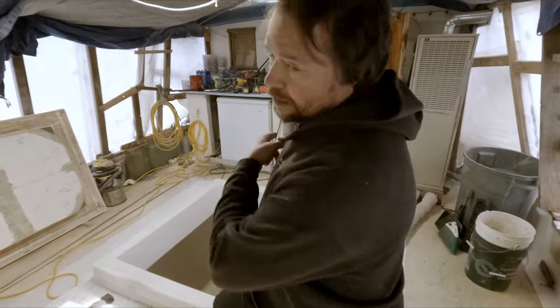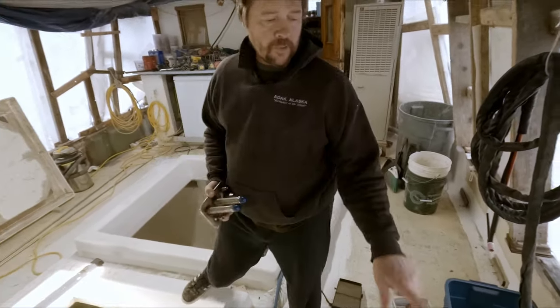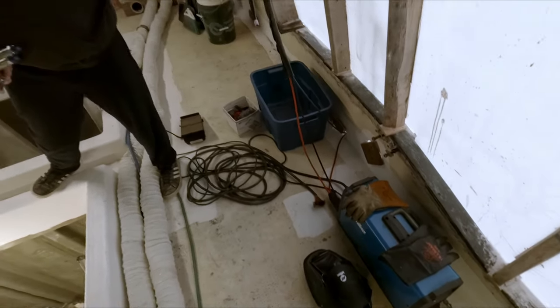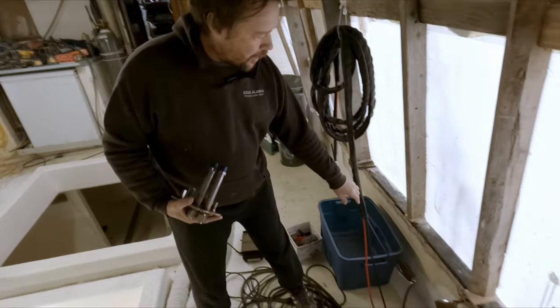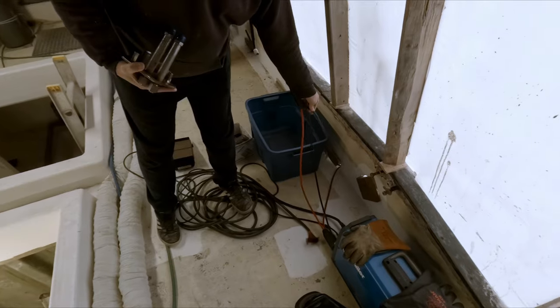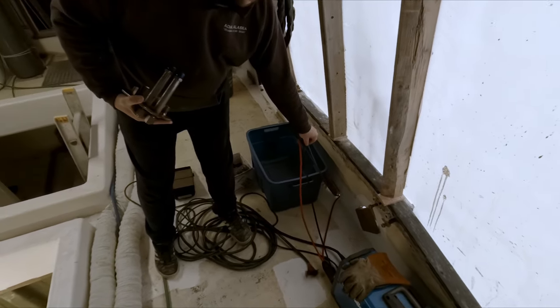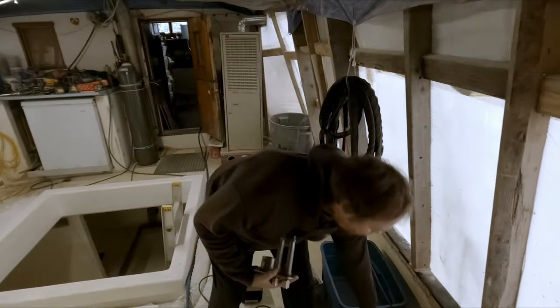To do that, we had to get our generator fired up. So that's what you hear in the distance there. Our welder is 110 or 220, but they weld much better on 220. I didn't bother bringing the cooler down. Instead, we just hooked up a hose outside to the cold water side of this, and it's circulating water, so you're just dumping it back out through this line.